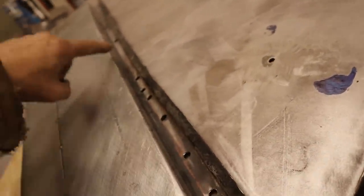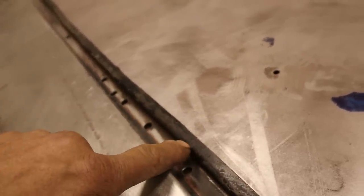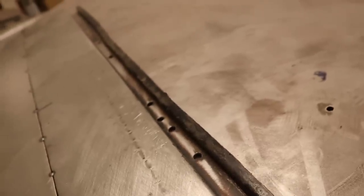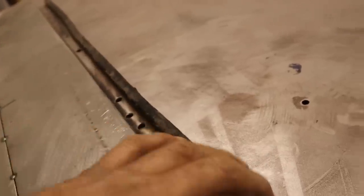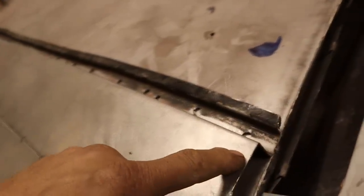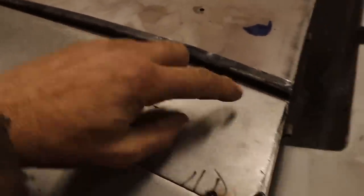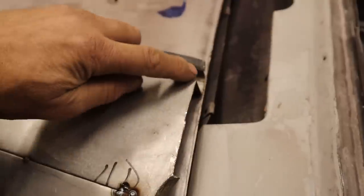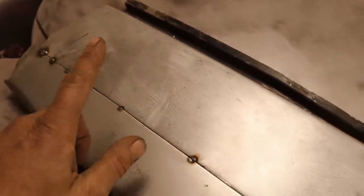Somebody asked why you didn't make the whole thing, and that's a pretty good question, and I considered it, except that you can see that this flange in here, you have to fold there, one, two, three, four extra folds, none of which would be very doable in a brake, and it actually dips down a bit for the latch in the middle. I even considered making it up to here and just welding it in there, but what's the difference, right? The reason I left all this is because here is where I've cut it away from the original piece. So if I don't get too cute, I should be able to just weld that right back in when we're done. And that should pay me back for some of the time by not doing it up to here.